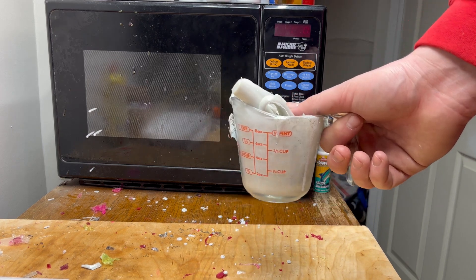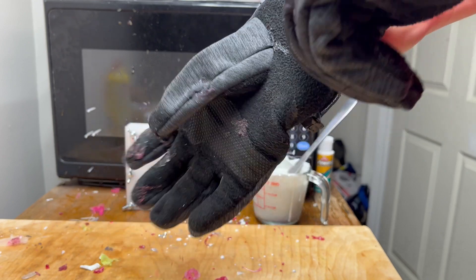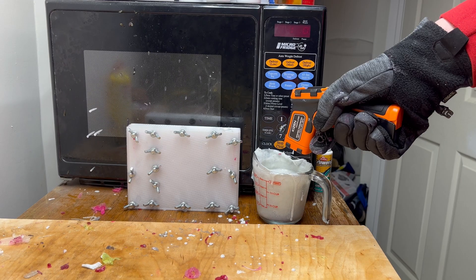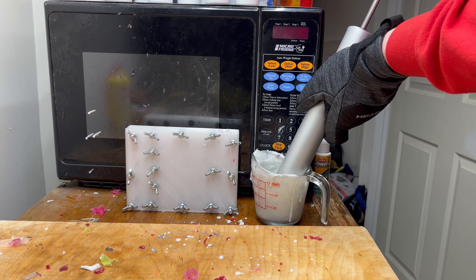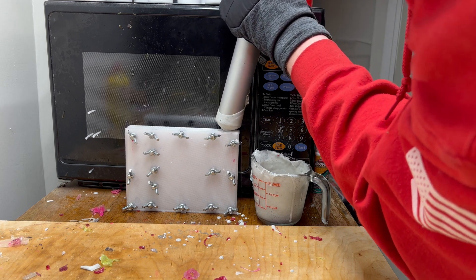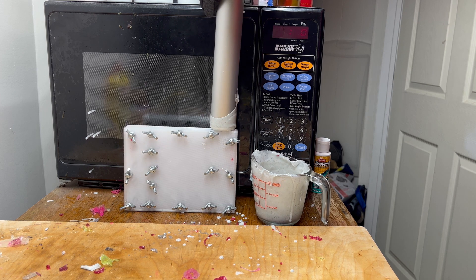I'm going to heat this up and put the mold together. So we've got everything ready to inject — we're going to put our gloves on. Don't not wear gloves, it doesn't end well. I want to make sure this glitter is suspended; it sinks pretty fast. Temperature is at 316 — perfect. This new bait plastics cools down faster than dead-on plastics, so you can shoot it a little hotter than you normally would. We'll burp the injector and we're good to go.